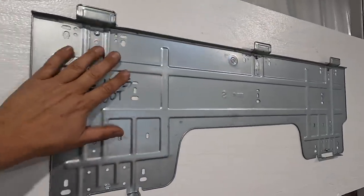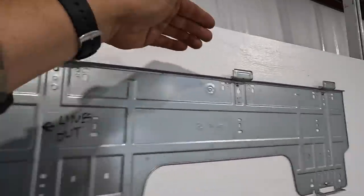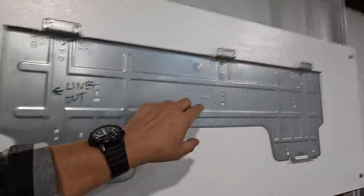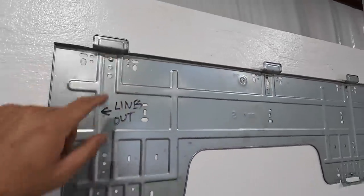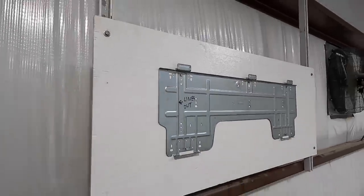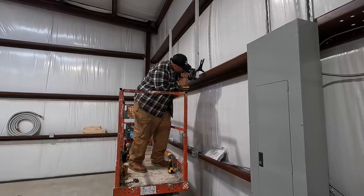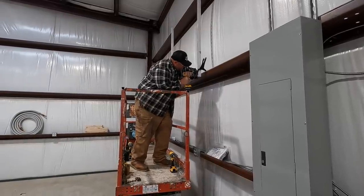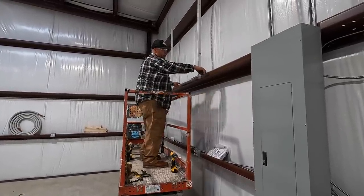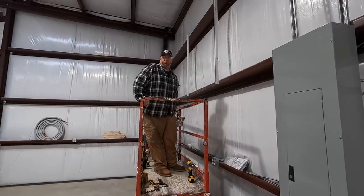This is the metal plate that the air handler sits on. It sits on the hooks up here and then snaps into the bottom. I just start with the middle, get it level, and then put four more screws around there — five screws total holding that on. We went ahead and piloted it first with a quarter-inch bit all the way through the wall so we can go around out back and already have a pilot hole to line up the hole drill for the sheet metal.